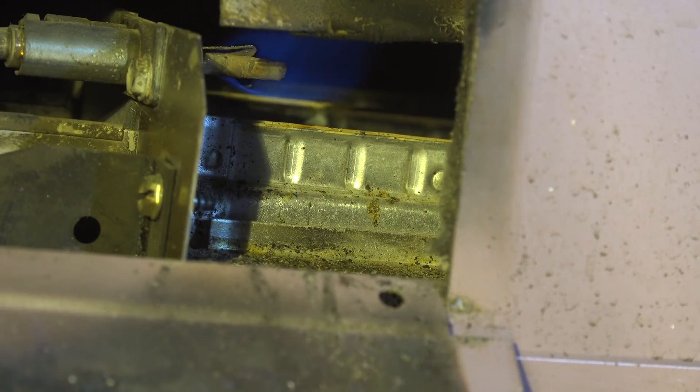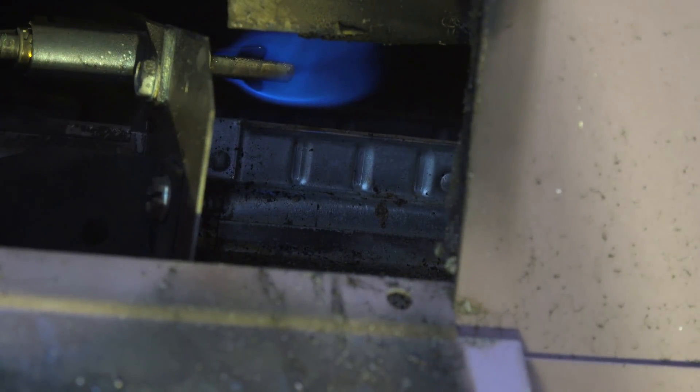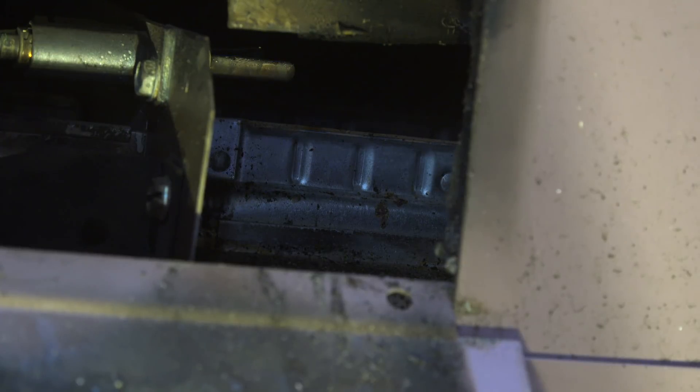You can see the pilot going. Let me cut off a light here. Okay, you can see that pilot a little better there, and it's covering the thermocouple — doing a good job. So I'm going to let off the button. Okay, it shut down. I'd left it on there for quite a while, even preheated a little bit with that torch, and it still safety'd out.